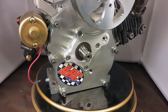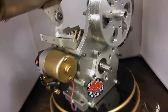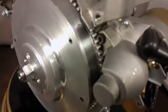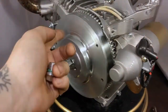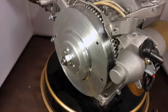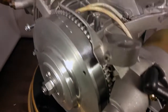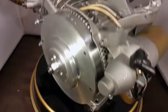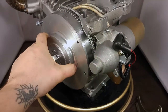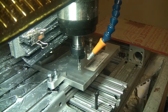I got my head reassembled and the rest of the engine reassembled. The front plate is all reassembled and the engine is closed. I have a starter — I've modified the flywheel to remove the fins since we have a propeller for cooling. I've also machined it to accept the ring gear. There are charging coils on the inside to charge a battery for electric start, and I tested this — it works exceptionally well.